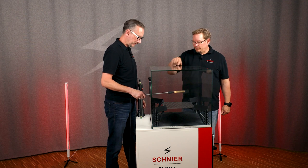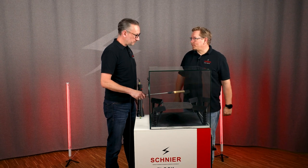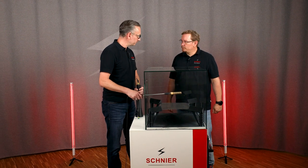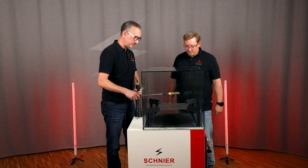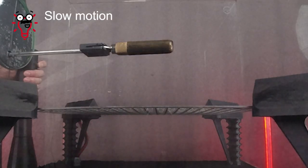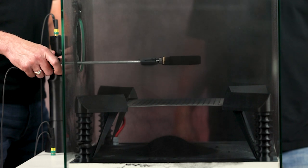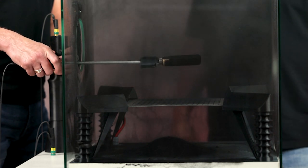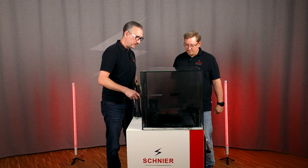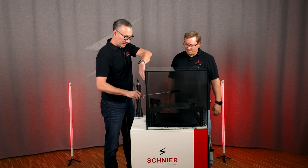That means if you're not turning the opener, in the beginning we are going to see that there is flock on the backside too, although the field only comes from the underside. You already explained that in another video. I'm going to start now, and you can see what is happening. I'm still rolling now — we've already seen that the flock is also on the back. The good thing is that it is not possible to flock too much. Once the adhesive is full, flock fibers simply cannot be taken. As we can see, this also means that we still have excess flock on the surface.